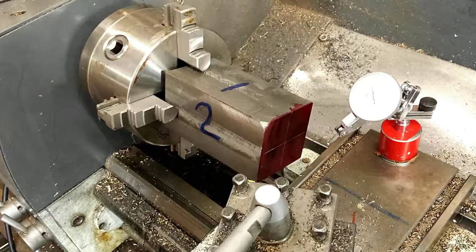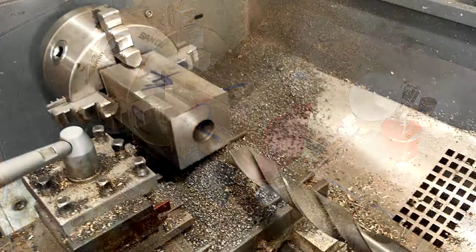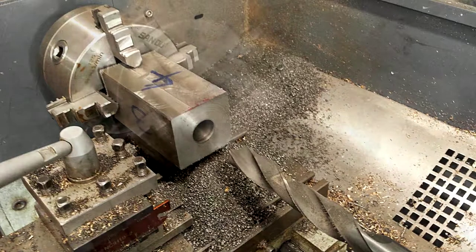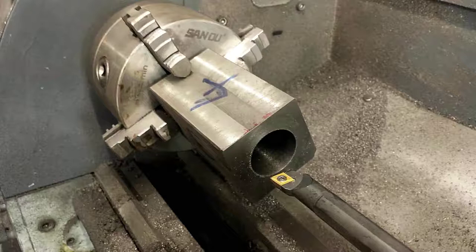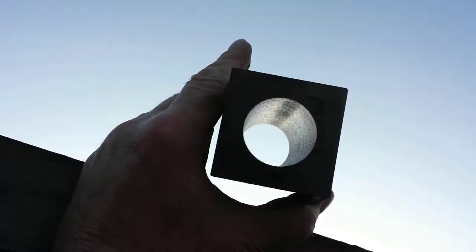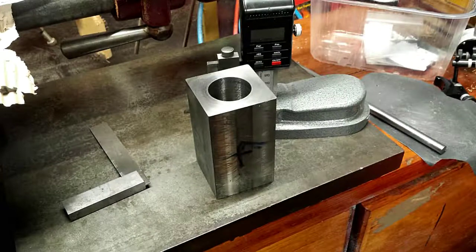You don't want the bore of the cylinder to be anything other than parallel to the outside faces. I then started to drill it using a succession of drills going from smaller up to the biggest drill I have, then bored it to size with a boring bar held in the tool post. There is the cylinder bored, framed against the evening sky — looking not too bad, just finished with the boring bar, sitting on my surface plate.